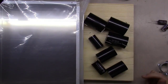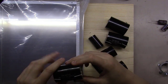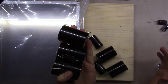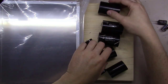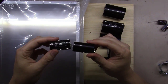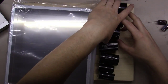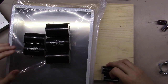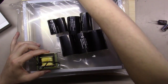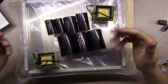Here we have the MKP capacitors - on the filter supply side, this is 33 microfarad. You're going to need three of those underneath this chassis. As you can see, these things are a pretty good size. You're also going to need two 22-microfarad MKPs and two 10-microfarad MKPs. Look at how big those are relative to the entire amplifier chassis, and you've got to fit those underneath along with all the tube sockets, wiring, and power cords.